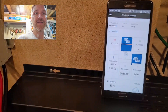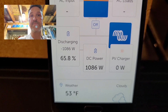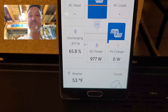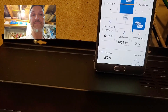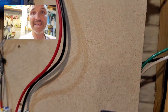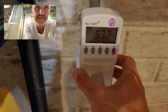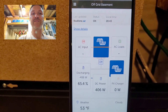It's coming from my batteries. Now looking at my off-grid setup, I'm now using over a thousand watts of electricity total, because about 630 to 650 watts are being discharged from my batteries through the wire, through the grid tie inverter, and back into my house at a rate of 538 watts. I'm going to turn this off now because we don't need it — the sun isn't shining, it's nighttime. You can see my system drops back down to 400 watts.